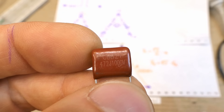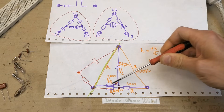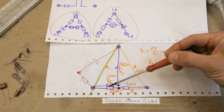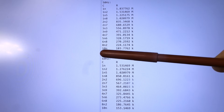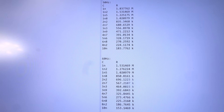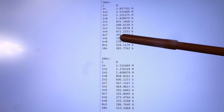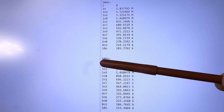I have a lot of 4.7 nF 1 kV capacitors, so let's calculate the resistors around that. The resistor in series with the capacitor has to be a specific value; the ones in the divider are not critical, but for simplicity you can use the same values for all three. I've made a table of resistances to use with specific capacitor values from 1 nF to 10 nF. Under 1 nF the neon lamp would be too dim; above 10 nF the current would be more than needed. Coincidentally, the resistances for most common capacitances are close to standard values — for 4.7 nF it calculates to 391 kΩ, super close to the common 390 kΩ. This is frequency-specific, so there's also a table for 60 Hz instead of 50 Hz.